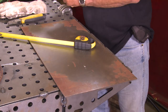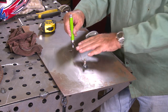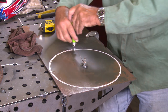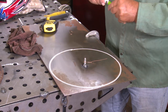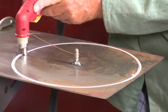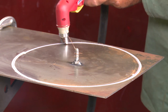That measurement may vary with the size rim you happen to use. The trick is how do you make a nice 11-inch circle? If you don't have a big compass at home, what I did was take an ordinary bolt and tack weld it to the center of my steel. Then I measured out a radius of five and a half inches on each side. To draw the circle, I ran a piece of wire out of my gun — you can use string or anything else, the wire was just handy. I tied one piece of wire around the stud sticking up and the other end around my marker, giving me my 11-inch diameter, and just scribed my cut line. Very simple — it's a pretty nice circle, way better than I could do by hand. I'm going to use the same premise with the plasma cutter to cut it out.